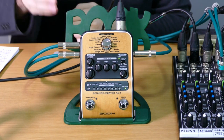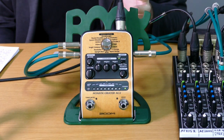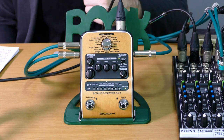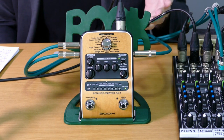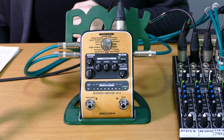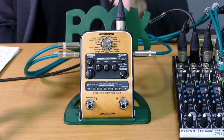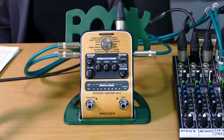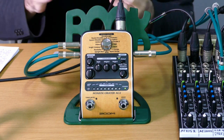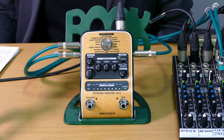The headphone amplifier, which is built into the left quarter-inch output, is, in my experience, nothing great. It worked well enough on my Sony earbuds, but any attempt to connect a professional series of headphones, such as my Beyerdynamic DT770s, resulted in a sound that was really quite bright and not very loud. It's also important to note that there is no separate headphone volume control. The output depends on the main volume control on the front panel. So I think this headphone output is designed for home or on the road practice rather than professional studio or stage use.